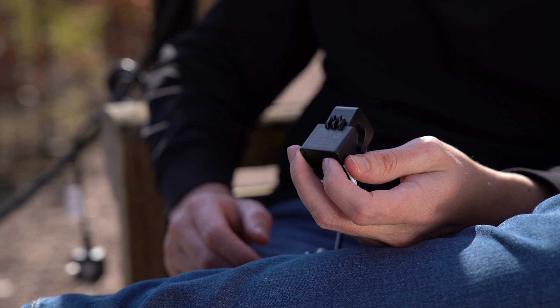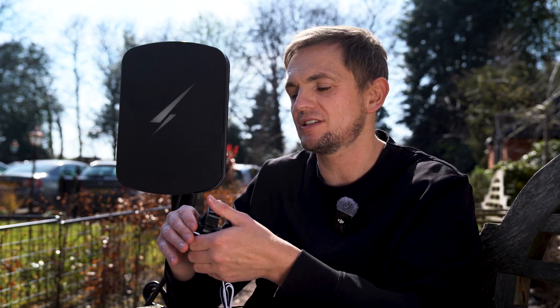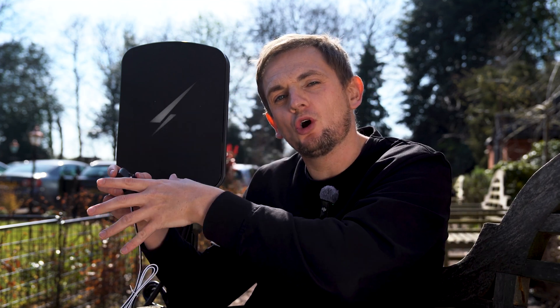There is another option that's come out since the launch of this product relating to CTs and home storage batteries. What you don't want is your home battery — which has been charged up either from solar or off the grid — depleting into your EV. This happens because EV chargers sense a load and pull it from the property, and your battery then sees that load and supplies battery power to the EV. This only works on AC coupled solutions — if you have an AC coupled battery, you can fit one of these. It's called battery protect, and when the charger is active, it will stop the battery from depleting, keeping your battery to power your home rather than your EV.